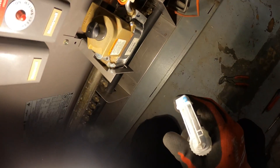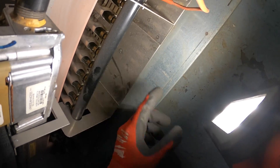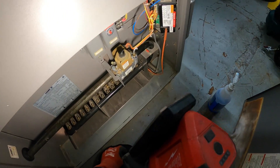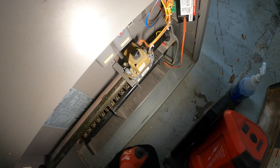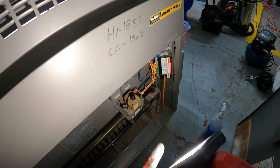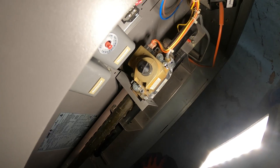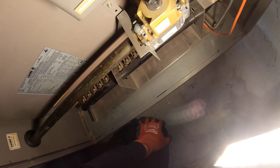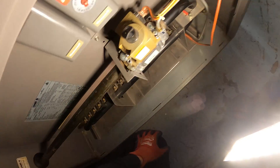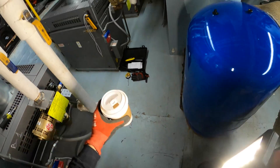Spray these, start the unit, make sure there are no leaks. We also need to vacuum inside here — I see a bunch of contaminants, which is not good. Definitely time for a tune-up. That's how we check and adjust our gas pressure on a boiler or a furnace — it's going to be the same thing. The same adjustments will pretty much apply with any kind of gas valve for any burners or furnace. I hope you guys learned something new. If you found this video interesting or helpful, please drop a like, comment, and subscribe as I come out with new videos every week.